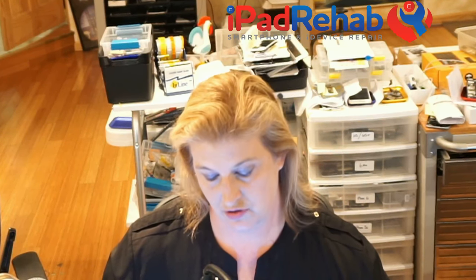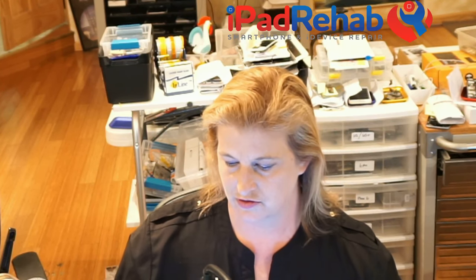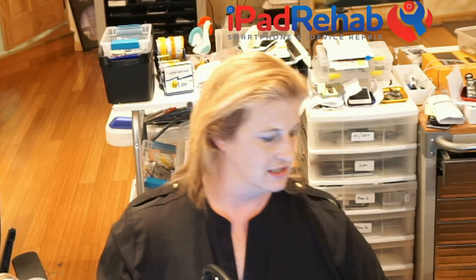And it's like Tristar is dead, but interestingly, it can actually boot. When Tristar was off, the phone could not boot. Putting Tristar on, but removing that 3-volt accessory power to the chip, it can boot now, which is interesting. There's something else about Tristar, that one of these other power lines, the 1V8 or the 3V SDRAM line, must be plugging in some kind of data that's going somewhere. So that's kind of interesting. All right, so it does not detect on the computer.